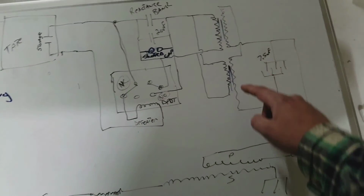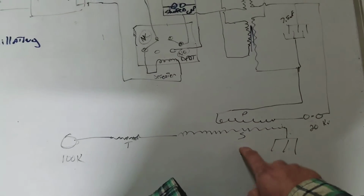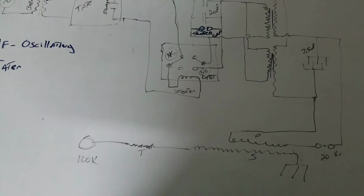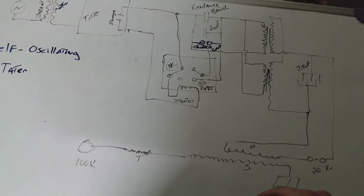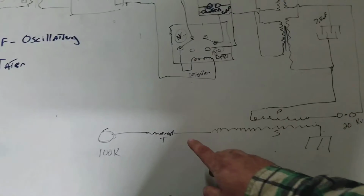Current travels through these primaries, and I get a small voltage output induction, and it is inducing into the big secondary step up, and I'm seeing somewhere around 10,000 volts come out of here at that time. Some little bit of plasma and a light bulb, and I can arc it maybe a quarter of an inch to a ground wire. Definitely some purple plasma coming off of it.